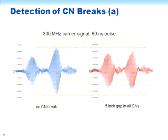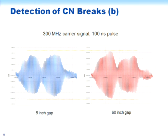And so this is the received pulse. Again, the input pulses are about the same. The received pulse here is somewhat less than the received pulse when there are no breaks in the CN. But at least this shows you can use this probing means to detect breaks in the CNs. In this case, it was a 100-foot cable, so I think the breaks were about 80 feet along. So at some distance, you can detect the breaks using this RF probing means.